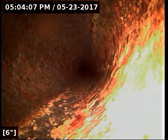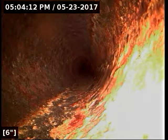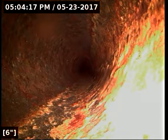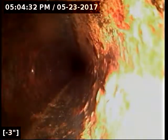And again, as a final rundown here, we've got a couple separated joints between the cast iron transition and the belly, and then a couple less significant ones after the belly. My main concern with the line currently is the belly from 28 feet to 41 feet. It's the most cost-effective time to do a full line update. I understand that cost can be an issue, but it'd be most cost-effective to do a full concrete update at this time. But the belly is the most important thing to get taken care of, and if that's taken care of, the line will be free-flowing and function just fine.